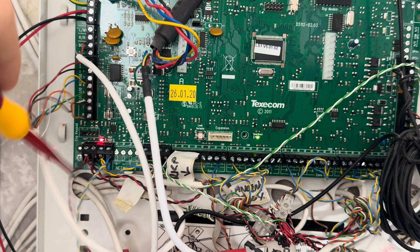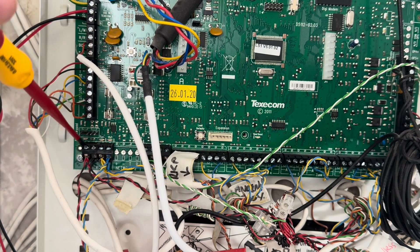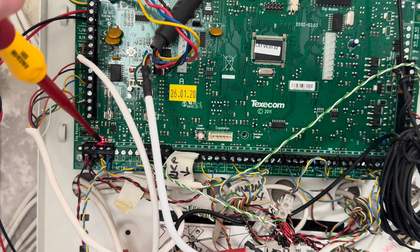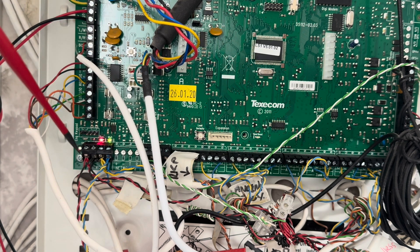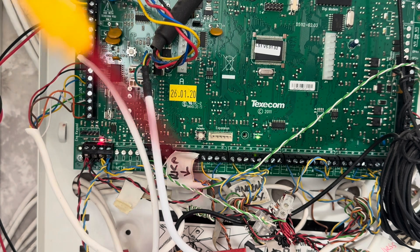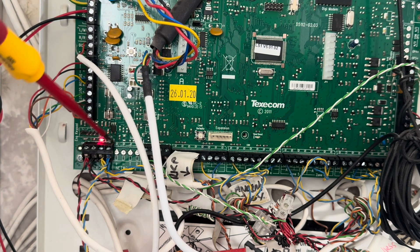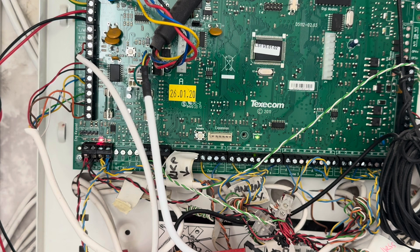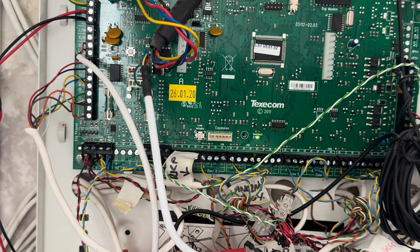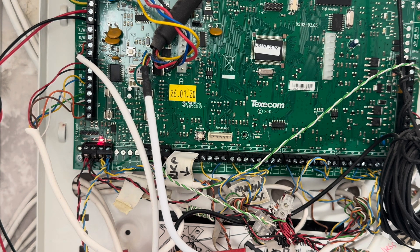The next terminals, very important ones — these are your network terminals. When I say network terminals, this is your power and DC power here that goes out to things like your keypad, expanders onto the system — wired expanders, wireless expanders. Your T and R are your communication lines for the network terminals. Four cores that put things onto almost a bus line for communication going out to all your expanders and devices from the control panel — keypads, wired expanders, wireless expanders. Not your zones — we'll get onto those in a second.